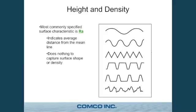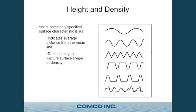Absolutely the most commonly specified thing we see is Ra, which is surface roughness — the average distance from the mean line. A downside of Ra that many people don't grasp is that it doesn't tell you anything about the surface other than how tall it is. All those waveforms on the right have the same Ra, and yet each one is going to give you different performance. Using that top very gentle sine wave to overmold won't be nearly as effective as the second from the bottom.